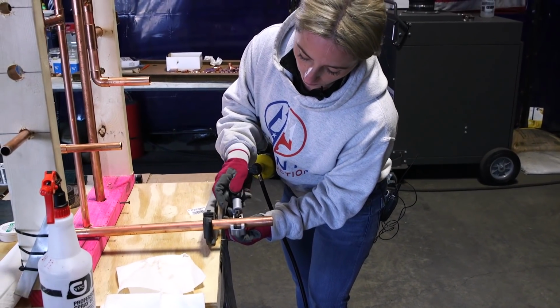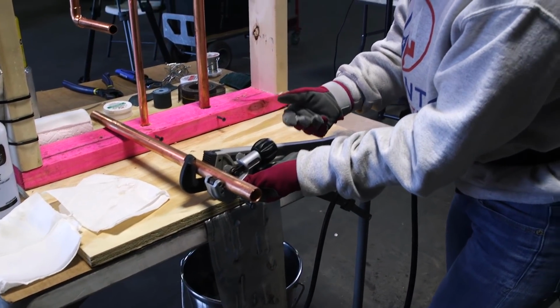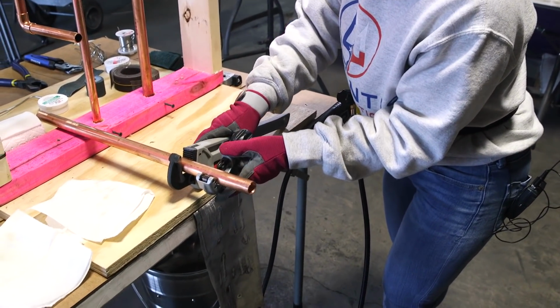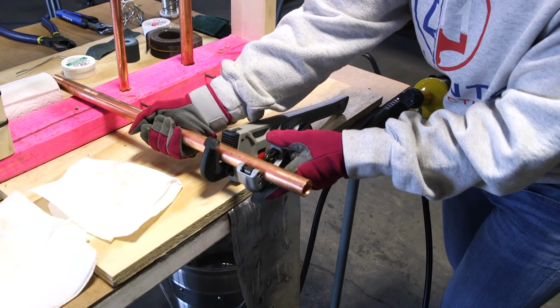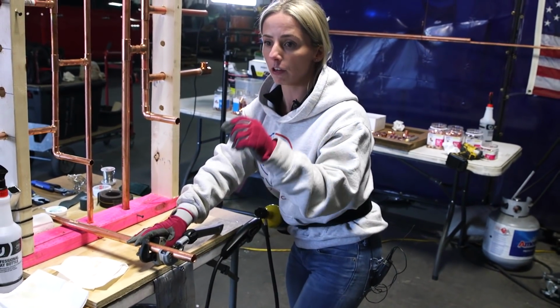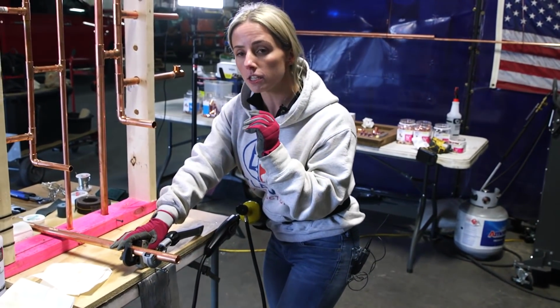you apply the cutter. Now, you don't want to clamp down too hard. If you clamp down too hard with the cutter, it's going to bend the copper pipe. Copper is a soft material and it can bend fairly easily. Instead, what you want to do, now since we torqued this in here in the pipe wrench towards us, I want to spin the cutter towards me as well. And with every turn, I'm going to tighten it just a little bit.